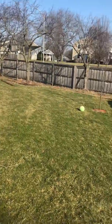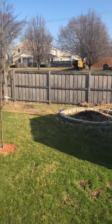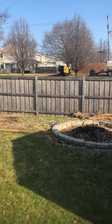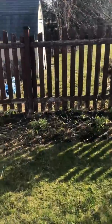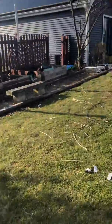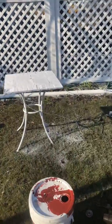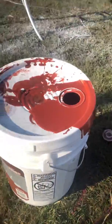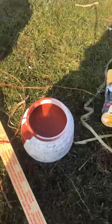This is a fence I got installed and it has not been stained. It's important to understand: you never want to stain a fence or any wood the first year you get it. The wood is not porous enough — porous means it will suck up and take in the stain. You can see this is some old fence from many years ago and the stain is coming off, so we need to respray it. Tip number one: do not stain until your wood is porous. It takes about a year of weathering — weathering means breaking it down and letting the wood get more sponge-like, so when we put the stain on, it will suck right into the wood.